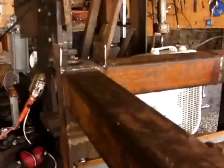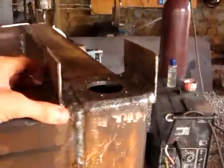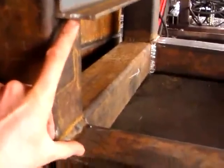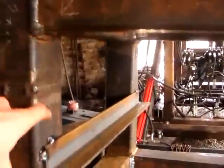Leak testing over. Welded some protective plates either side of the inlets. So I've welded the protection plates on for the fuel and hydraulic cap inlets here, and I've now tacked on the first 2x2 quarter inch angle irons. They are 7 inches from the base tube here, and that's also 7 inches coming here because these sides are 16, as we can see written on here.